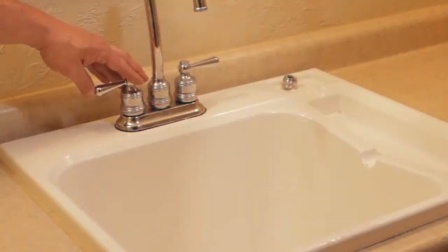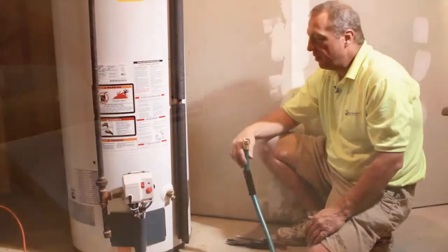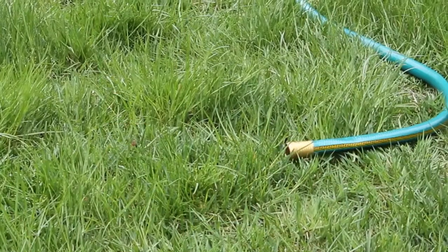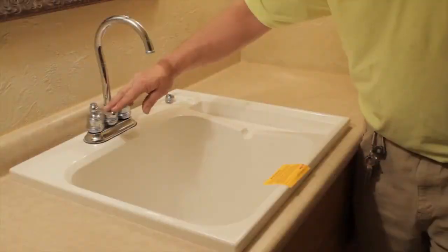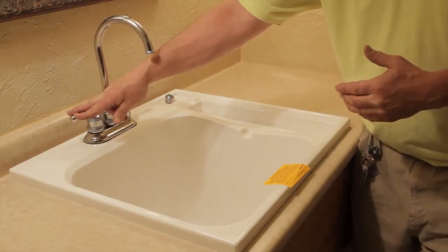After the appropriate water valves and breakers are shut off, you will start a gravity drain by opening all the faucets and valves, and by draining the hot water tank with a hose into a floor drain or outside away from the foundation. Once the gravity drain is complete, close all faucets and valves. It is important that all faucets and valves are opened, drained, and then closed.